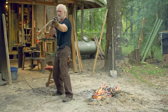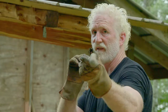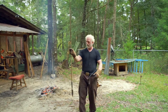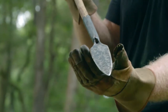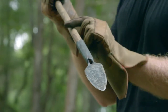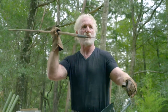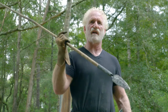From what it was, it looked like a banana. Now look at it — it's a usable spear. There's a kink right here, but that's a knot, I can't get that out. Now it's straight — straight enough for throwing anyway. See how much spine it has? That's what you want in the spear. You're talking about the wound channel — it's going to be that wide. This whole shaft goes in behind it. Because this is narrower than the tip, it's going to follow through since it's thinner. That cuts the channel; the shaft follows because it's small. That's the key to spears — they have to be very thin and wimpy. That way, when you throw them, they're real light. That's what the Maasai have learned — they're very lightweight, and they're devastating.